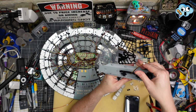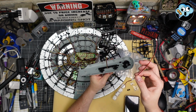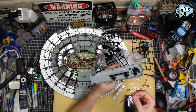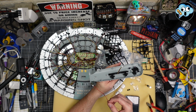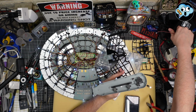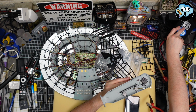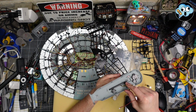And this is a fairly thin wire, but the thing is, you have wires this thin anyway, powering like the entire saucer. So you'll have like 1 or 2 power wires, I don't know how many, going in from the battery boxes into the circuit boards. And that saucer, when turned on, is going to be pulling over 2 amps of power. Now, I promise you, there's no way in hell this thing could pull that much power. So 28 gauge wire is going to be just fine. 30 gauge would probably be fine even.